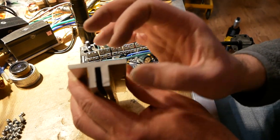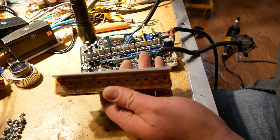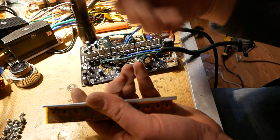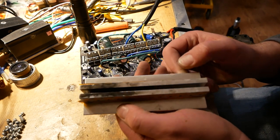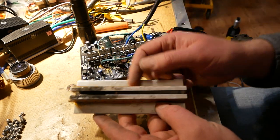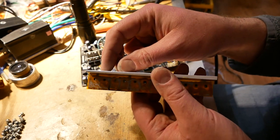Look at this thickness — it's about six millimeters thick at one end and about two and a half, maybe three millimeters thick at the other. Edge-on you can see it's a nice big wedge. You want all your MOSFETs doing the exact same thing when it comes to heat and cooling. More aluminum mass equals less heat; less aluminum mass equals more heat. Down there where there was less aluminum mass, that's where the MOSFETs blew up. Those MOSFETs could have very easily been ready to go into thermal overload and then they did — because there was just a little bit less cooling there.